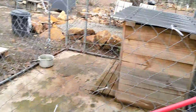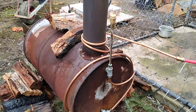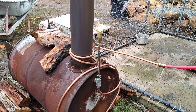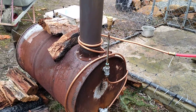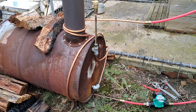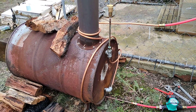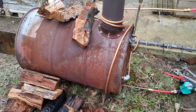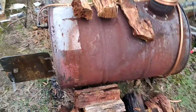Anyway, this is just a rough cobble together to see how many turns and things I really need on the flue, because it's always a compromise between getting enough heat in there and also creating creosote. So this is just a test and we'll see how it goes.